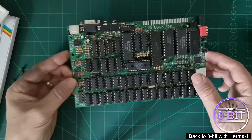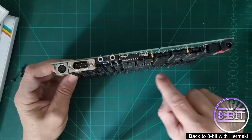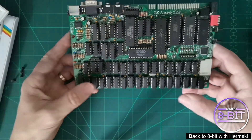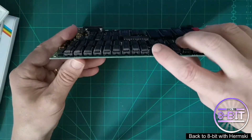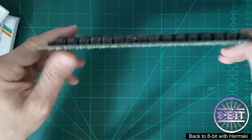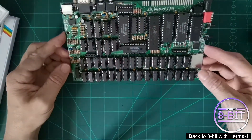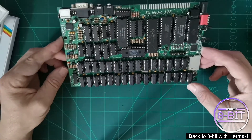All these chips are actually socketed, and I'll show you some pictures of the original board in a little while. The reason why these are socketed is it allows you to take the chip out easily and replace it if needed, without having to de-solder — because if you've had to do that, you can make quite a mess, potentially removing tram lines from the back of the board since the pins are so close together.